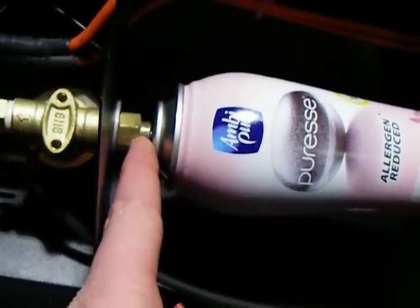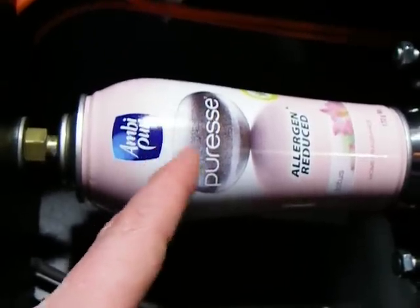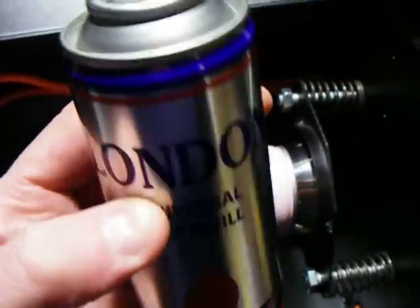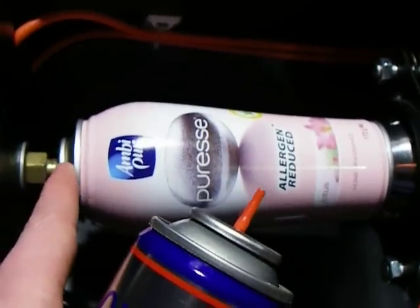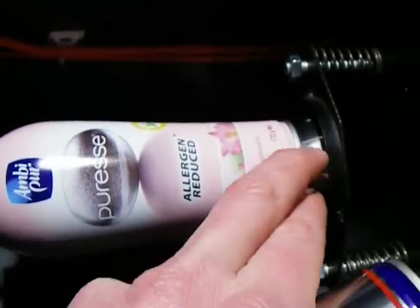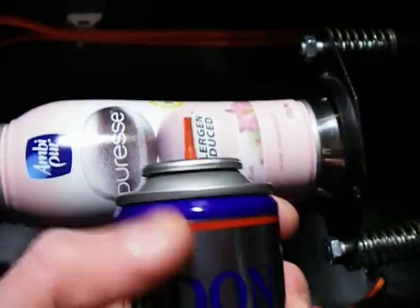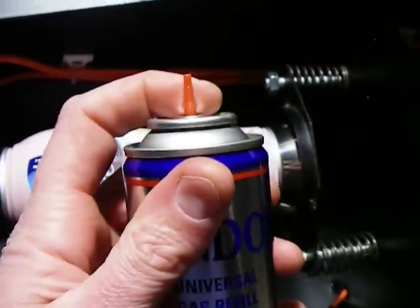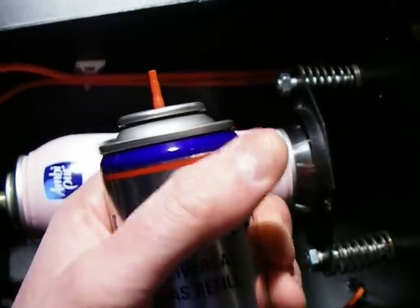The fact it's pushed in means that it's releasing the liquids — the butane, the propellant — in here. It would have been nice to use this little butane canister used for refilling cigarette lighters, but this doesn't have a dip tube, and that's quite important. In aerosol air fresheners, a little tube goes down inside so the pressurised gas actually blows a mixture of butane and the aroma out. It's important that this unit gets the liquid out, as opposed to just the gas off the top like would come out of a standard butane lighter refill — if you put that in the unit, it would work, but it would end up with maybe a one-foot blue flame.